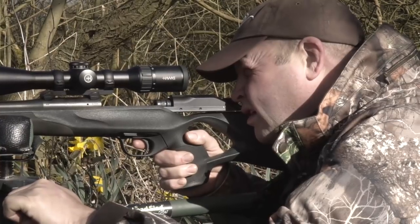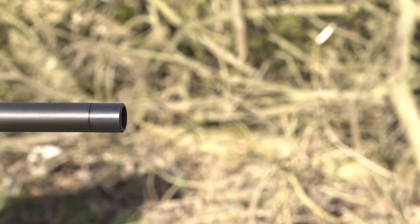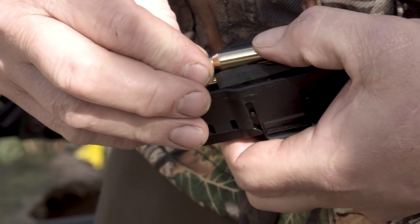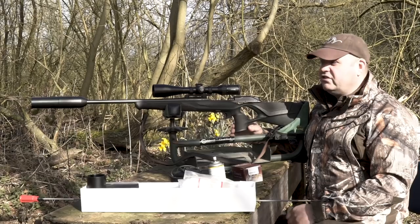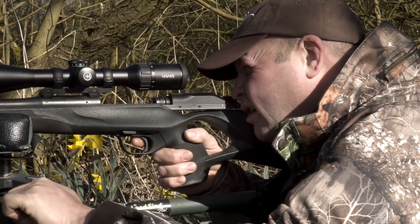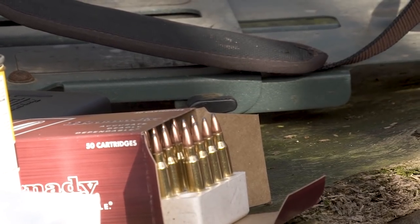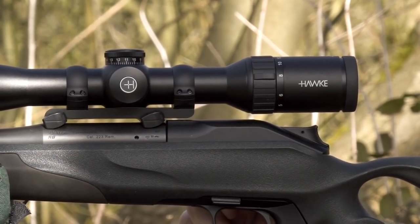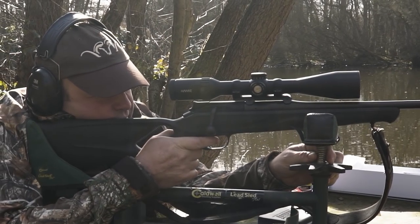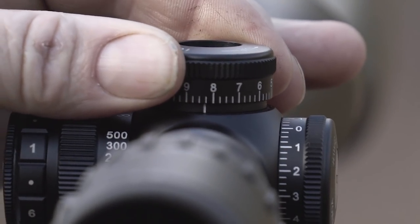So what we're going to do now is fire a couple of shots and then clean the barrel, as we did before we started. Then come back, take another five shots, clean the barrel again, and another five shots and clean again. We're going to do that until I've fired 20 rounds. The reason we break the barrel in is because when it comes out of the factory, there are slight imperfections in the barrel where they've cut the rifling, which grips the bullet and spins it. These are a little bit pronounced in some areas and not others — it's all to do with tooling and manufacture. Breaking the barrel in and cleaning it each time evens the barrel out, which will help it last longer.